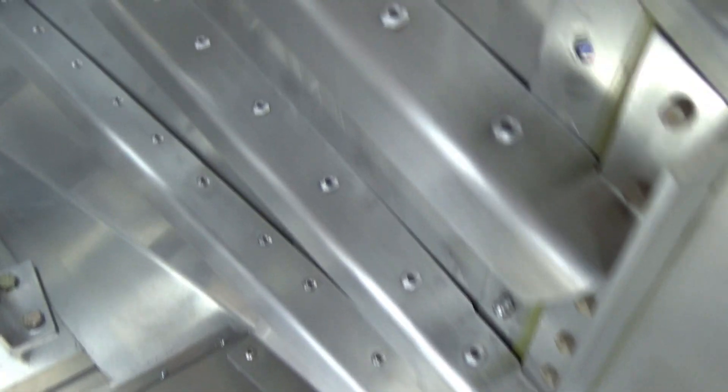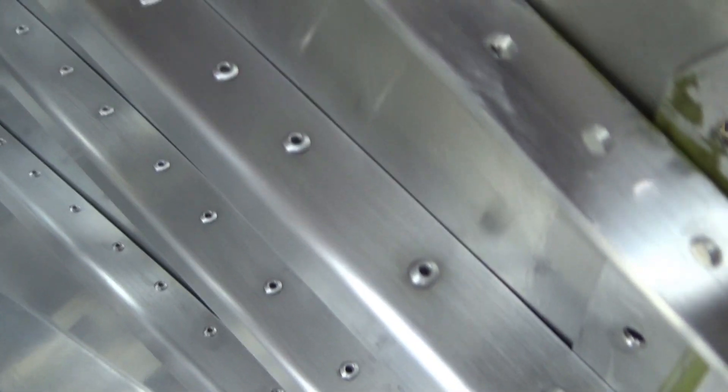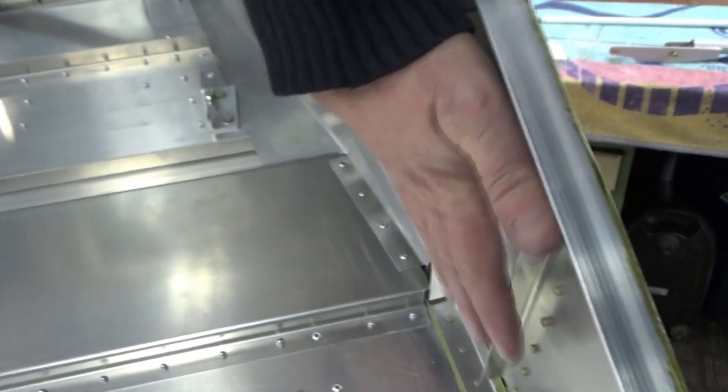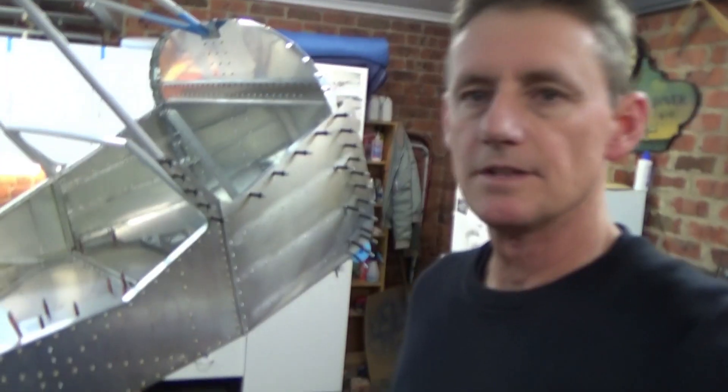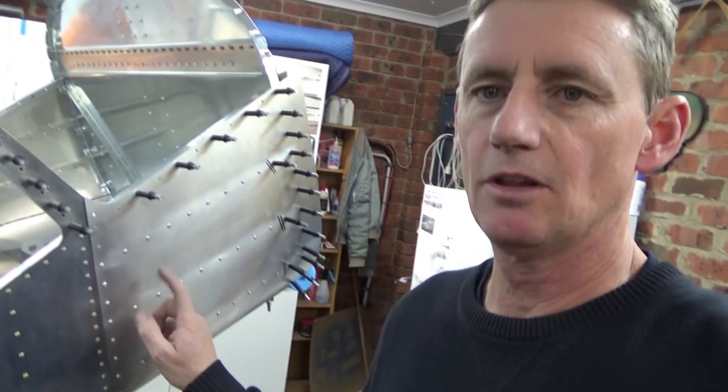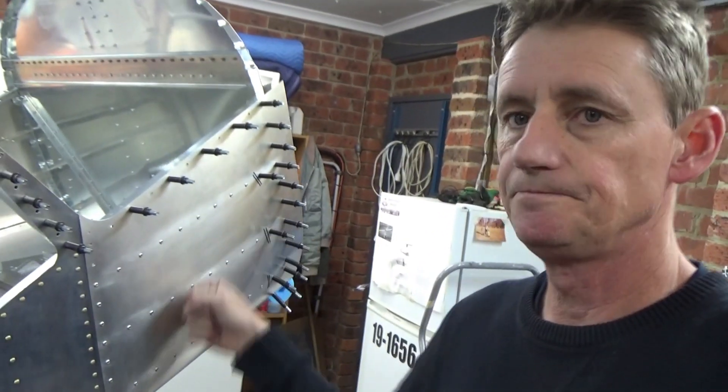It's taken quite a bit of time but as I gain experience it's working well. These are the parts you end up with — you can see the crimps that actually curve the L-angle. Two nights work. I've got the forward longerons riveted in — have a look on the inside. They're all looking pretty good, not a bad fit. I'd say about eight out of ten. I tucked the edges in so your shin or the passenger's shin slides past cleanly. Really happy with that — it gives a lot of strength there for the firewall.